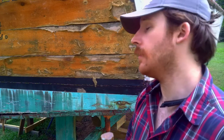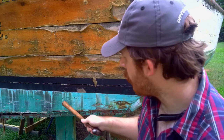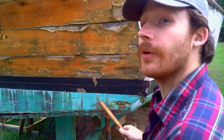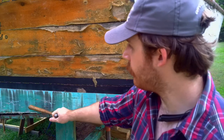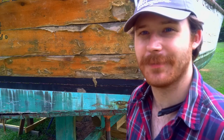One: she actually had a red hull. Or second reason: what a lot of old-timers used to do is put one bottom paint color down and then put another on top of it, so that when that top layer started to come off, they'd know it was time for another layer to go on. Pretty neat little old boat-building trick. I'm going to do the same thing and paint her hull back to the same original color — it'd be nice to keep that original to her.